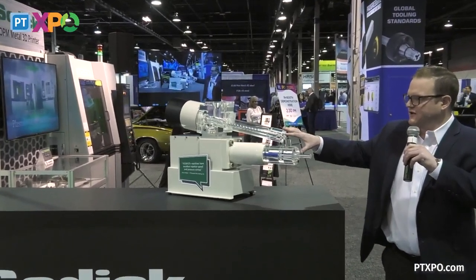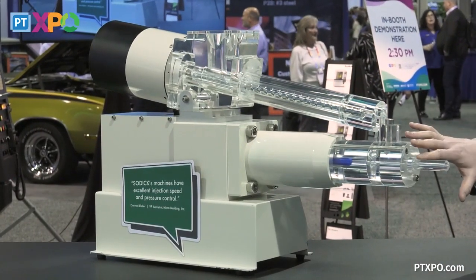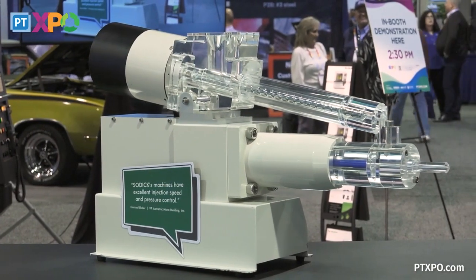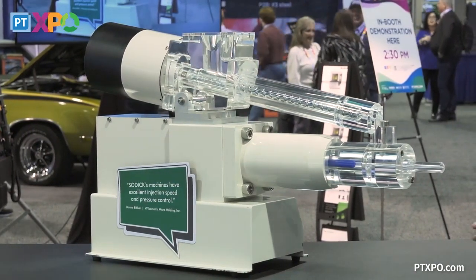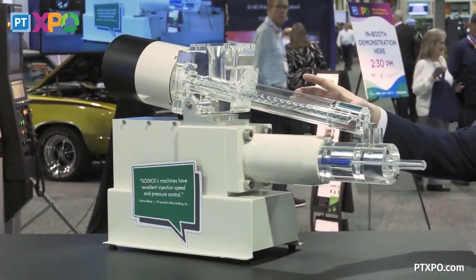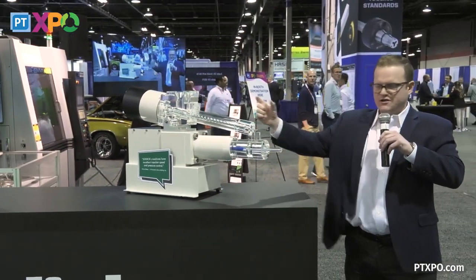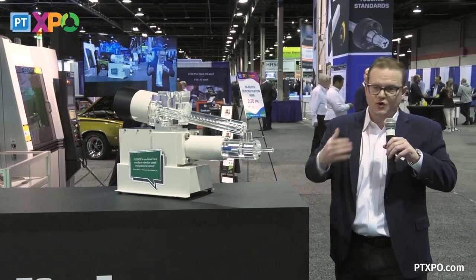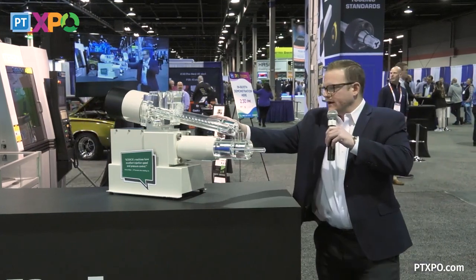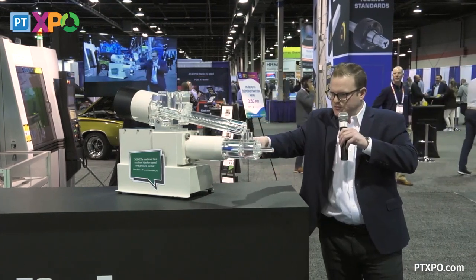What we've got here is essentially we're separating melting or material preparation from injection. So it allows us to really control both a little bit further than you might on traditional molding equipment. First and foremost, you're utilizing a stationary screw, really an extruder, to control that shear heat, versus a back and forth reciprocation movement, which could result in excess shear, maybe yellowing, burn spots, things of that sort. Now we're building one shot at a time, so material's being metered here, pushing the plunger back.